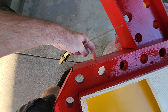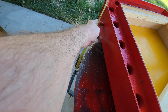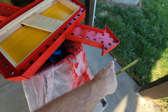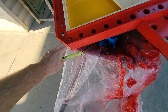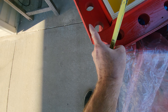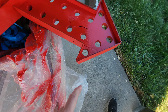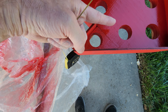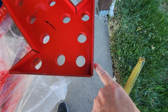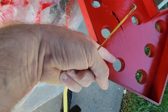We're going to hang it — probably put an eye bolt somewhere here and here, suspending it from the tree, with maybe some guy wires on the bottom. These corners are quite sturdy: there's a screw on a 45 and another screw on each corner, and I glued them so they won't fail. I cut these pieces off at a 45, flipped them, then glued and screwed each one.